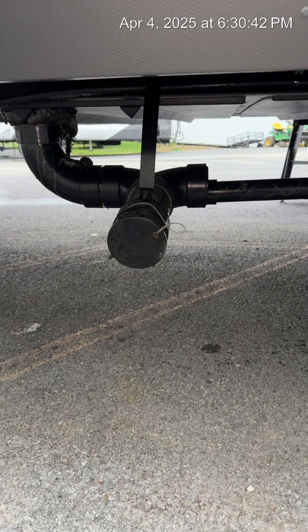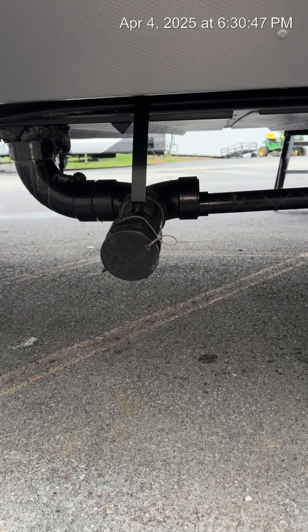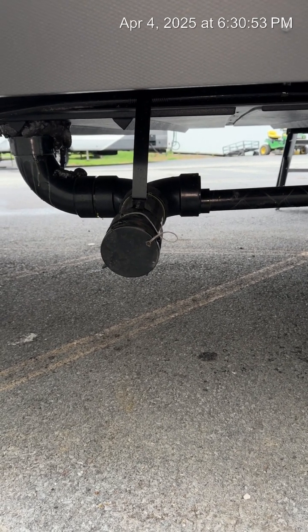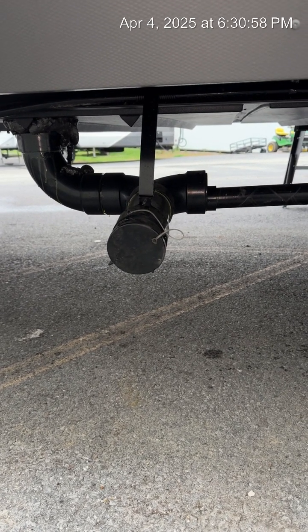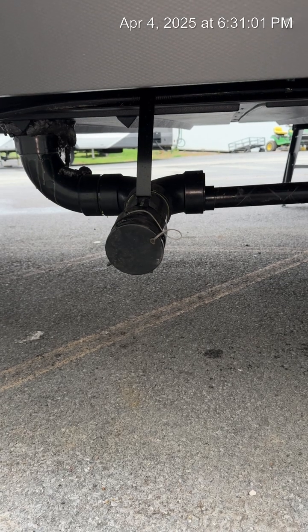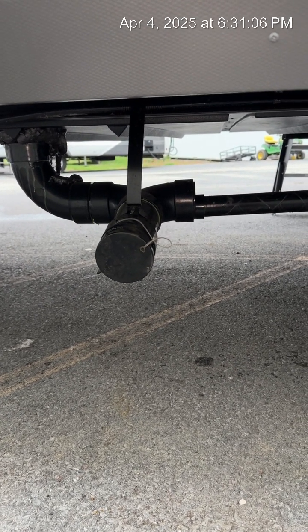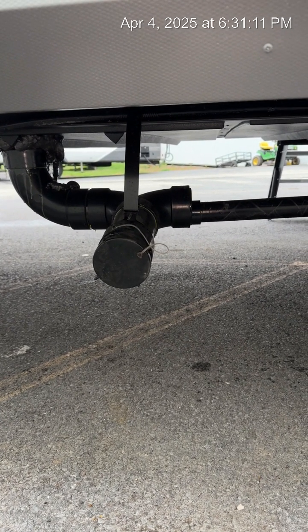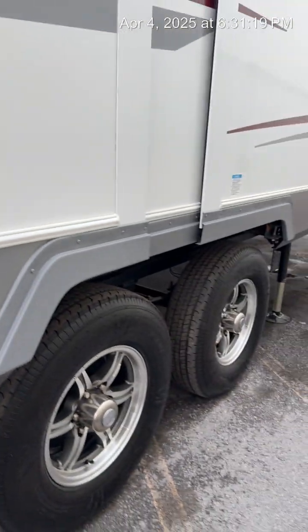The other thing that could potentially happen, again, it's not normal to have it happen, but sewer gases will make their way into your camper and it's going to smell like a porta potty. Nobody likes that. And you'll know people who do it because you'll walk into their camper and that's the first thing that you smell, that they've left their valves open, hooked to sewer. So let them fill the tanks about 2/3 full and then come out, pull your valves, black, gray, galley, and then close them. All right? That's it. Okay. I know I talk a lot about the black tank, but it's important.